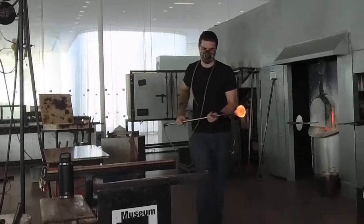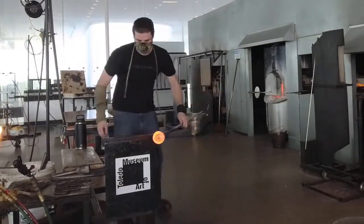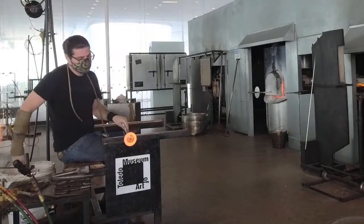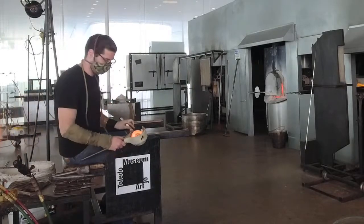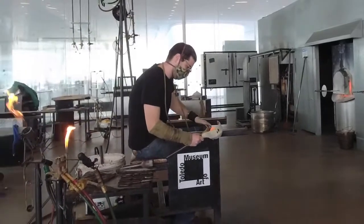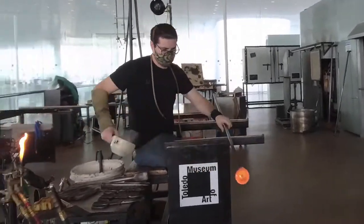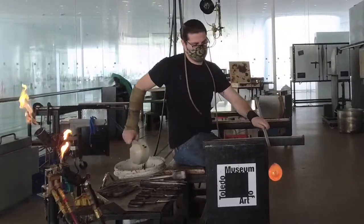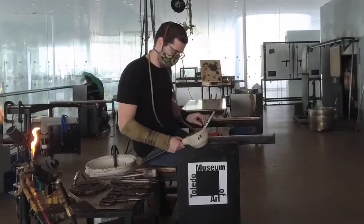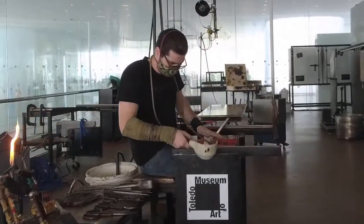So while I was talking about that, Misha's doing our normal setup that we usually talk about. This is the glass blowing part, right? So Misha's got that nice hollow tube. And you'll notice he's not wearing any gloves. All of our equipment pretty much is made out of stainless steel. So it's a really bad conductor of heat. If Misha's pipe were made out of, let's say, copper, he's going to really burn his hands. But we need that dexterity in order to turn that pipe.